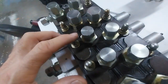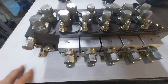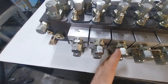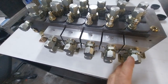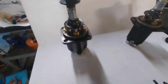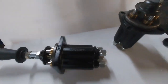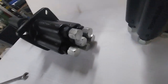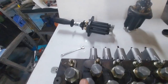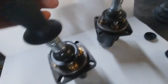To make these work you need pilot control pressure — you need to supply these ports with up to 400 psi of oil pressure. To do that you usually use a joystick or pilot control joystick. This joystick will operate two of these spools and can even operate two ports simultaneously depending on how you move the lever.